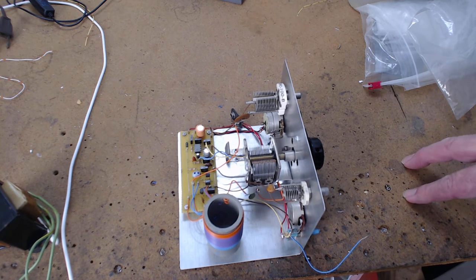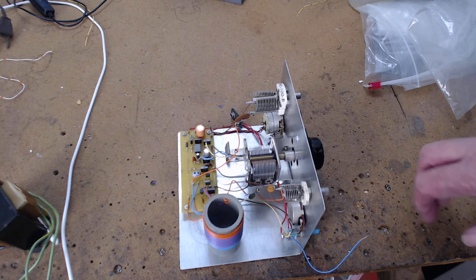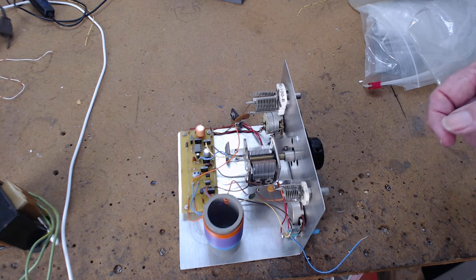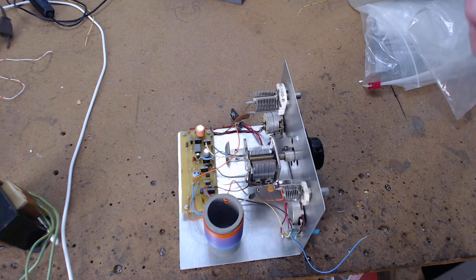And I laid it on a piece of wood. I used the contact cement to mount the tuning caps. And it looked like a beautiful thing, and it wouldn't work. Because Cy Burger gave me a pair of headphones, or an earphone from a transistor radio, and it was 8 ohms worth of copper in it. Low impedance. That's all you have to understand, is not enough wire. And it doesn't have enough resistance. So the circuit, the bias goes all off on the transistor circuit, because you don't have enough resistance or impedance or enough windings, no matter how you want to word it.